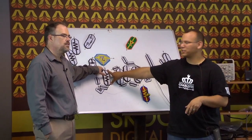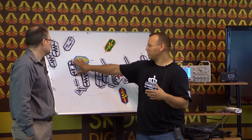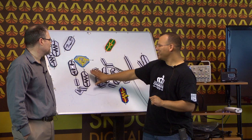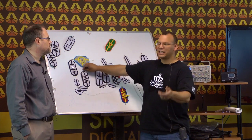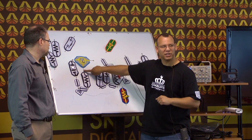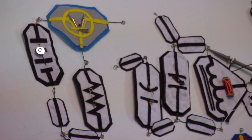Right. Yes. Absolutely. So the one thing is that transistors are used in amplifiers. They amplify a signal, but people tend to make the mistake of thinking that if I've got a 6-volt battery here, I'm going to amplify that and get like 100 volts. Well, no. What you're going to do is take a small signal here on the base, whether it's a really tiny signal, 0.6 volts or smaller, or bigger, depending on what you're doing, and amplify it up to the available power, which is 6 volts in this circuit here. So that's what the transistor is doing.